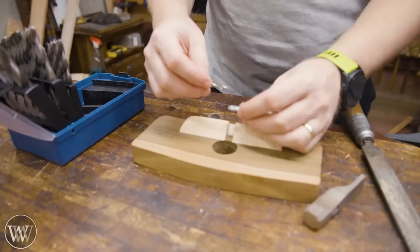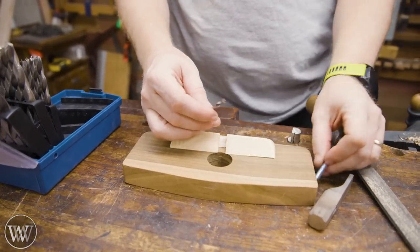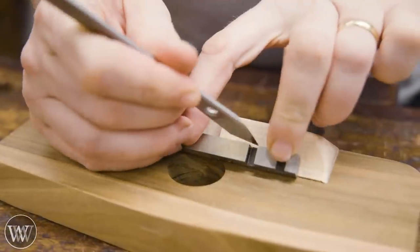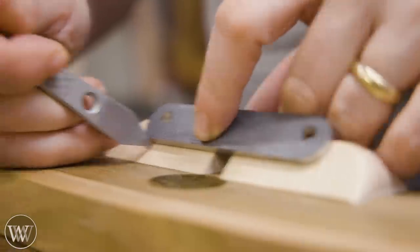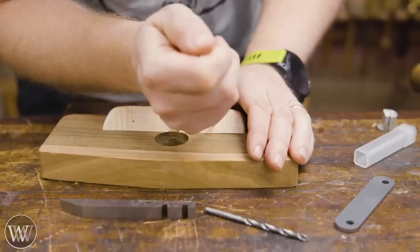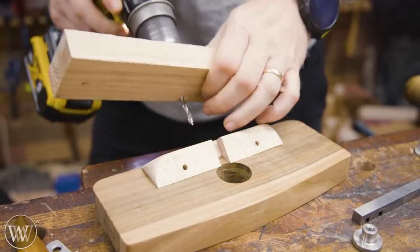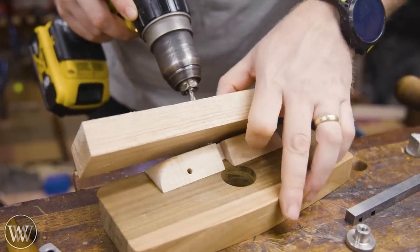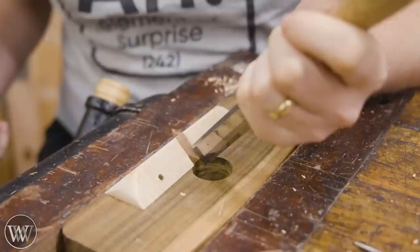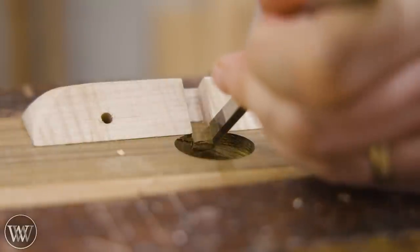The router iron, you can see, will slide down through that, and then we have to cut out a little bit more for it to fit into the main body. The kit provides three of these screw bolts, and so we need to pre-drill the holes so they don't split everything out. They need to be separated for this frame to hold on to and up the body the same thickness as the iron — the plans give you all of those measurements as well. So we can drill two holes through the front and one hole in the back. This one in the back will be where the adjuster bolt goes in. We're using this same frame to keep everything true and 90 degrees to the face that they're running into.